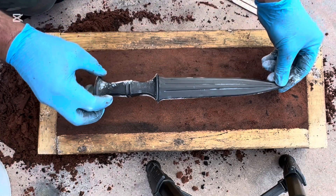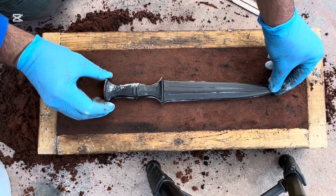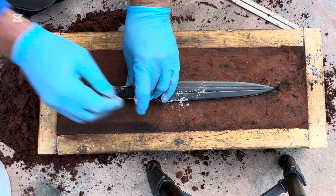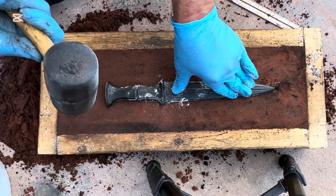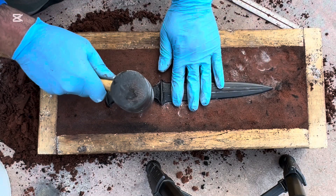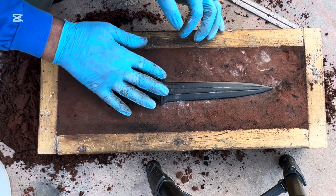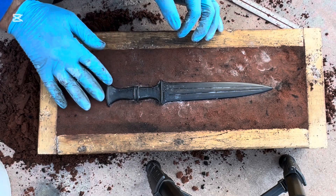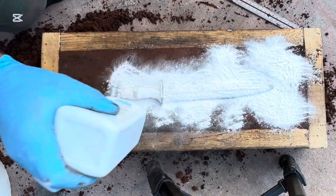For this project, I used a plastic model of an ancient Egyptian dagger. For the side of the dagger that went down first into the sand, I had placed some baby powder. I basically pounded this thing in so that the bottom half of it was embedded in the sand. For something shaped like a dagger, this technique worked just fine. I did some extra compression with my fingers where the sand met the edge of the dagger, and now I was ready to place baby powder all over the bottom half of the mold.